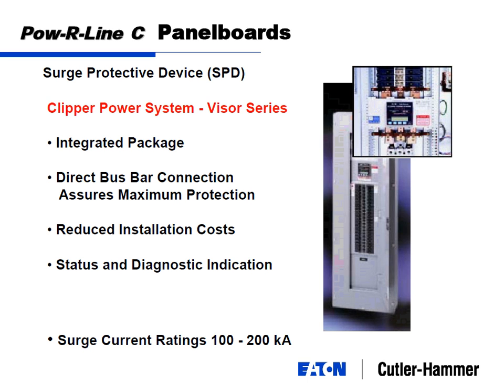Other questions on SPDs? You tie it in the panel. Where do you land them? When we factory mount it, these are little copper pieces. The copper pieces on this device actually bolt right to the A, B, and C bus bar. Any transient voltage that comes up, say a feeder breaker, back to the panel board, once it hits the main bus, the SPD will take care of the transient off the main bus.